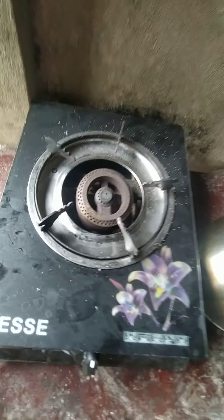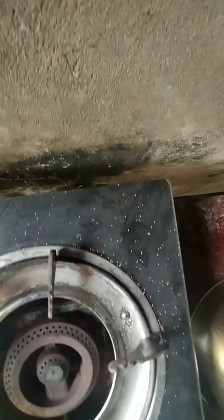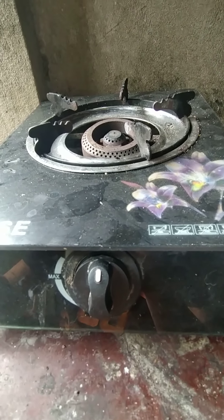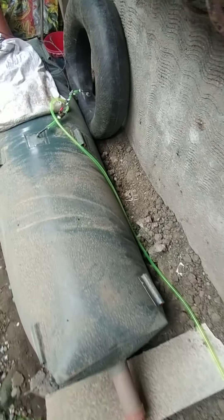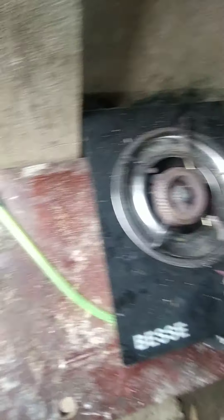This is the line going to my burner. Let me show you the burner — this is the control valve here for you to easily use it when you are going to cook. I'll show you how I directly input that into that metal, which will spread the fire. I need to put it directly there because the control valve on that tube is designed for high-pressure gas. Since the gas in my biogas is not compressed, I cannot use that one, so I'm just going to use this line right here.